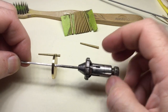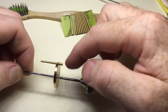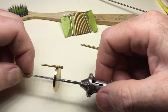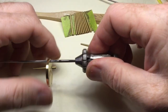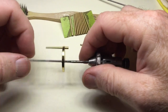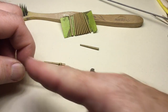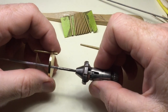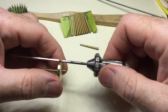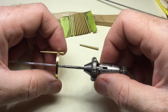When using a broach, I was watching carefully from one angle and it seemed to be going alright, then I changed my view and found I was at a very steep angle. You can change that — just apply pressure in the direction you want it to go. If you'd gone too close to the edge, though, it might have broken out and caused all sorts of headaches. Go gently, go carefully, and keep switching your view to check both the x-axis and the y-axis.